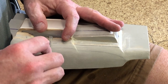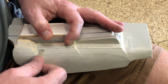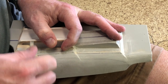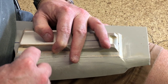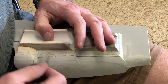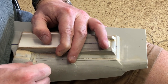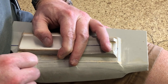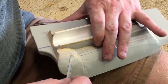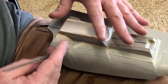I've also found that you want to go up and down this way. If you start going sideways, it's really easy to put an edge in and you don't want to do that - you definitely want to keep working this curve. As much as you can, work up and down. When I do go in the other direction, I'm usually using the file sideways. I want to make sure that this is a flat, fairly sharp edge, not some kind of a curve there. I want to emphasize that.